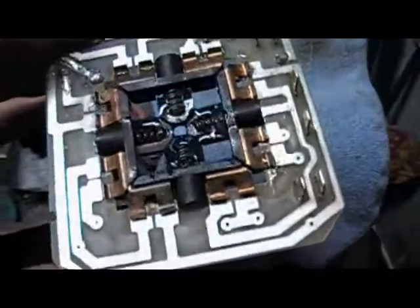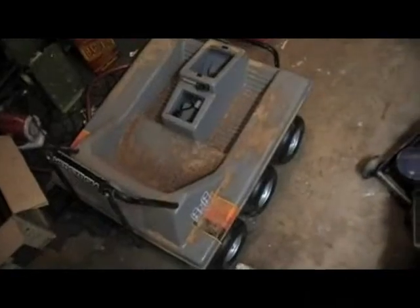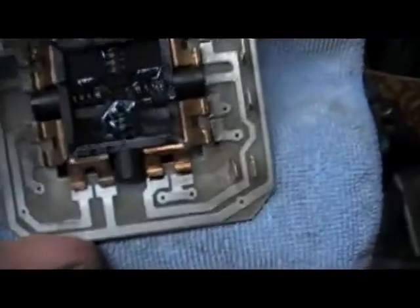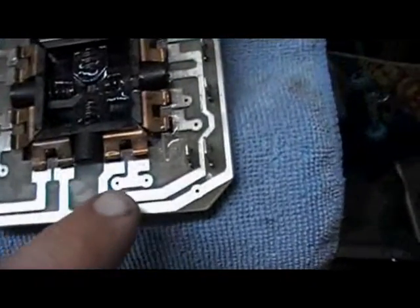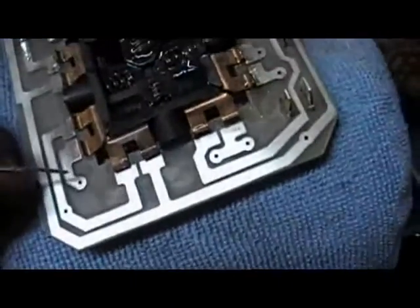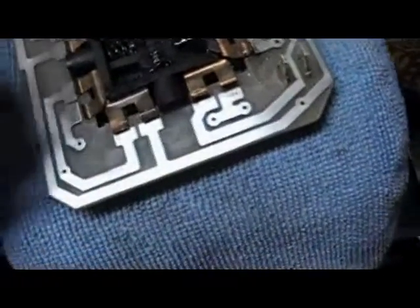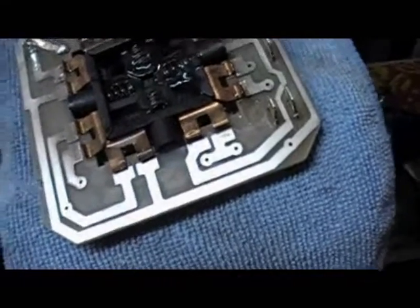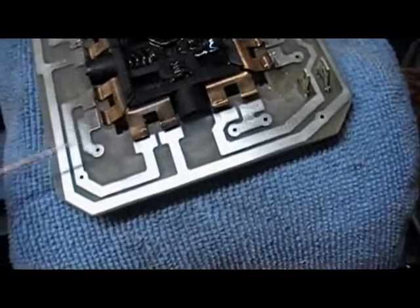Okay, this is the joystick board out of the Hedstrom Probe VI 6x6, and I've noticed if you cannot get power to the rear wheels no matter what you do, this is the problem with it. You'll notice on a lot of the contacts you'll have a hole, and that hole is a transfer port for power to jump to this leg on this side, on this lead. So what happens, I've noticed, is the little contacts are just pressed through, just overlapping and touching. That little contact inside will burn up, and you will lose continuity between the two halves of the board.